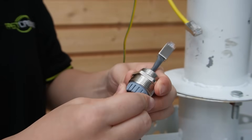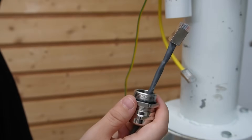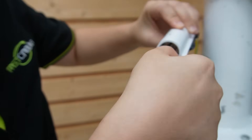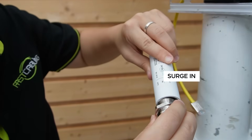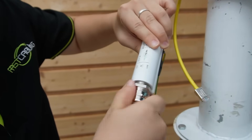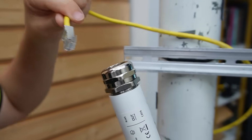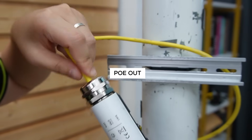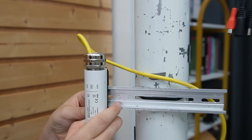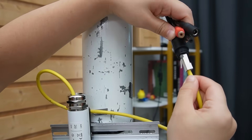Pull the neck and tighten it. During installation, use a wrench to fasten the neck and the gland tightly. Then plug the 100m ethernet cable into the inside port and tighten it. For the outside, we're using a short patch cord. Let's mount it back on the DIN rail, and now use the short patch cord to connect the outside to our PTZ camera.